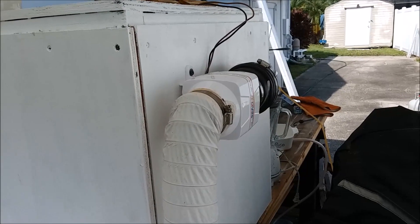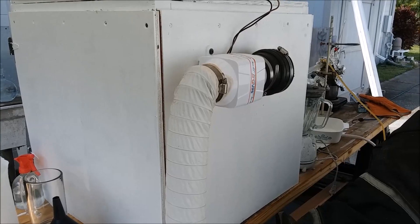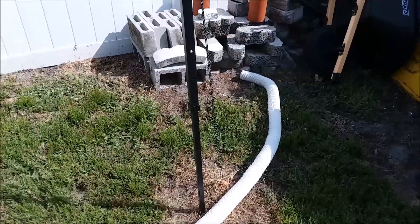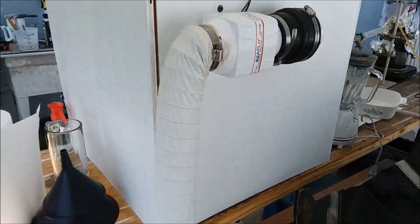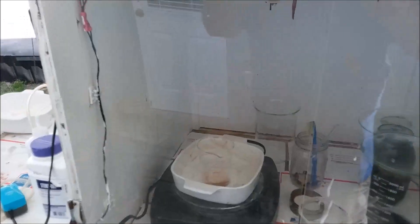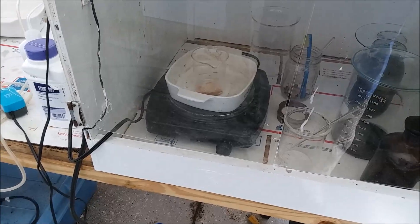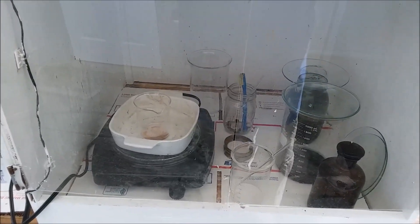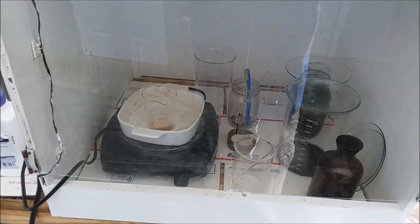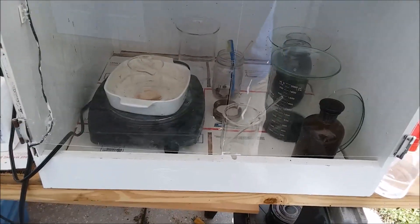Most of the gases I'm making are heavier than air anyway, and depending on which way the wind was blowing, stuff coming out of a stack would still hit me in the face. This works much better being down at ground level — I never smell it, which is great. I haven't come up with a fix for the lighting issue yet, but I've been using it mostly during the day and the lights going yellow hasn't really been a problem. I'll probably try putting some clear tape tear-off sheets on top of the lights so when chemicals yellow the tape I can just take it off and put a fresh sheet on.